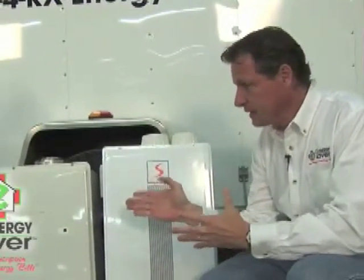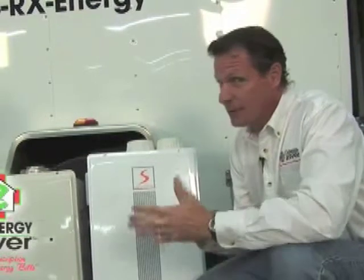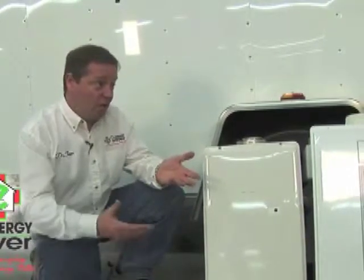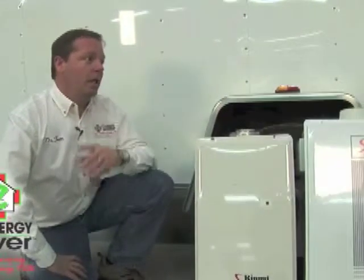When we talk about efficiency, we mean how well that unit turns fuel, whether it be natural gas or propane, into hot water. So if that's 85% efficient, if someone had a tank-style water heater that was maybe 12 years old, what might the average efficiency have been 12 years ago? Well, the average efficiency was low to begin with, and don't forget, after 10 or 15 years of sediment and rust and corrosion, it's even way lower than that. We find that the efficiency of a water heater is about 60 to 65%, which means 35 or 40 cents of your heat energy for the water is going up the chimney and outside. You're not getting it into your water, plus the standby losses, plus all the other things that go on.